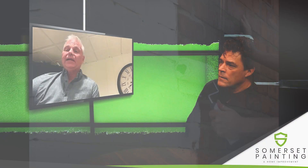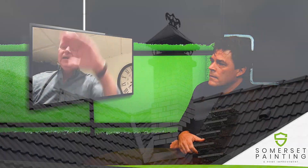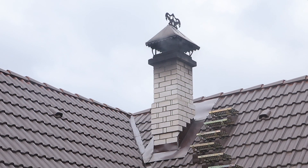Chimneys will peel — people need to know that. About fifty percent of the chimneys in Michigan above the roof line will peel if you paint them, because they're hollow and weather comes in and out of that chimney somehow — the airflow causes it to peel. People call up a little disappointed about their chimney peel. So we have it in our paperwork: if you're going to do it, you might expect that to peel.